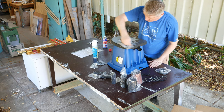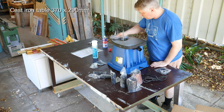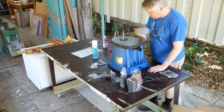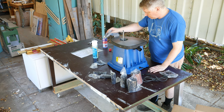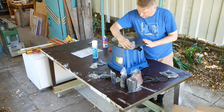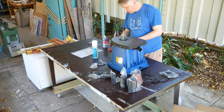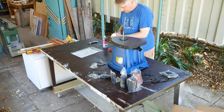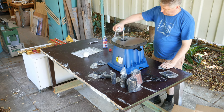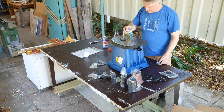The cast iron table comes with some protective grease on it, so I degreased that and then sprayed on some Lanotec, which is an Australian product based on lanolin — the oil in sheepskin — and that works very well to protect your tools. You can try that or Silverglide, which is a German product. I find Silverglide is not quite as effective but is brilliant for avoiding any residue on your work pieces. I'd recommend either to cover your work surfaces or machines.